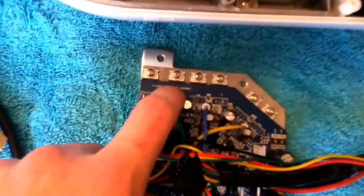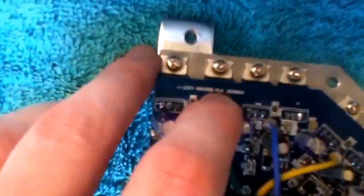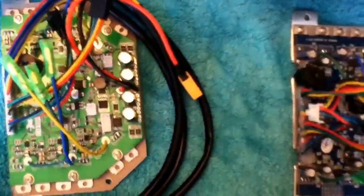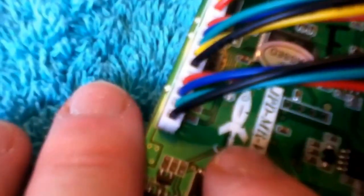The way you can tell the difference between the two is the serial number is usually going to be located on a blue circuit board for the motherboard, and it will say 1.0. The correct versions — the ones that fixed this problem — are going to be 2.0 and 3.0, which I have here. They're usually green and will have a little rocket ship symbol near them. Those are the good versions.